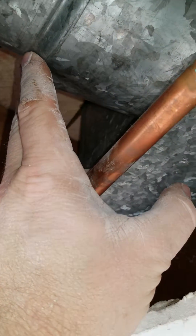This metal is going to be at 90 degrees when the furnace is on, and that area out there could be near freezing. So you have a lot of temperature difference in the winter and you can get condensation.